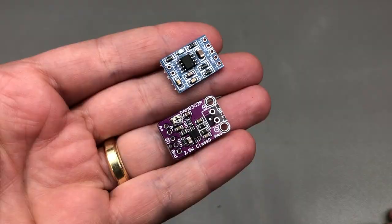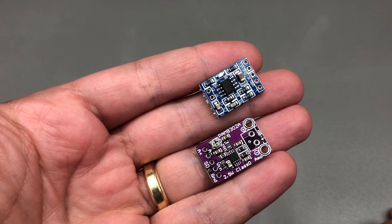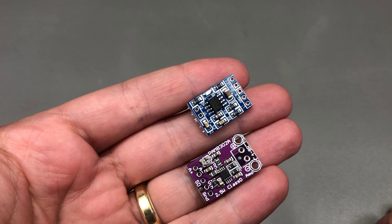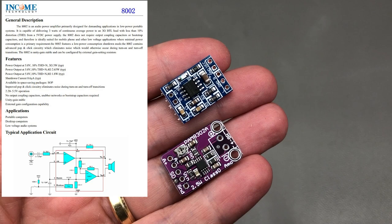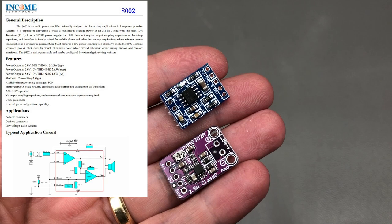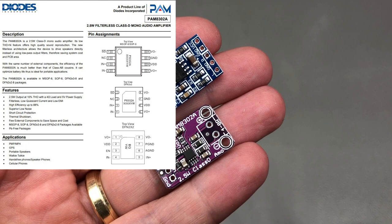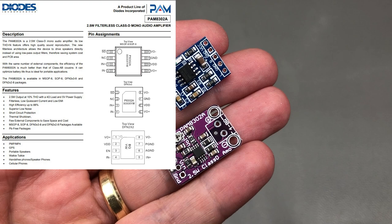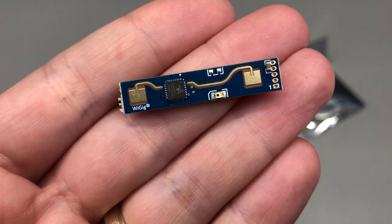Also for my activity board project, I was thinking I might need a very small audio amplifier to play some audio feedback. I looked through my existing modules and didn't have anything tiny that would work with a half-watt speaker. So I ordered two from AliExpress. The blue PCB is model HXJ8002 — a single channel, approximately 1 watt into an 8-ohm load, input voltage 2 to 5.5V, takes a stereo input which it mixes to mono output, Class D architecture. The second one, the purple PCB, is based on the PAM8302 Class D amplifier chipset — also mono output, similar voltage range of 2 to 5.5V, rated for 1.3 watts into 8 ohms. The only advantage of the purple board is an adjustment pot to fine-tune the gain.